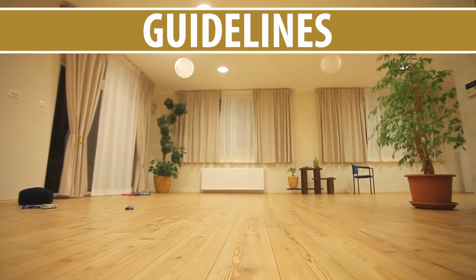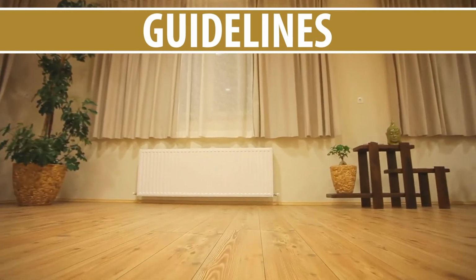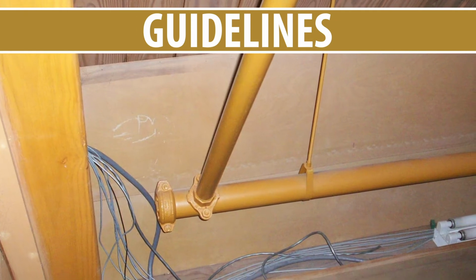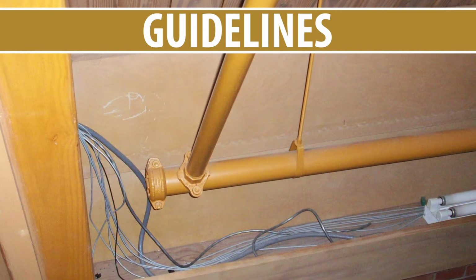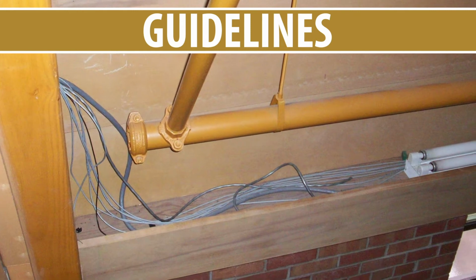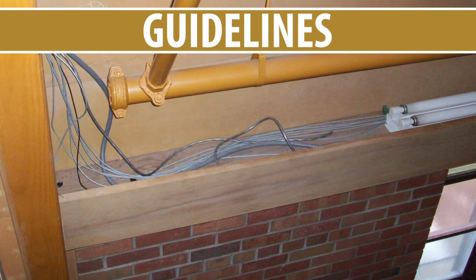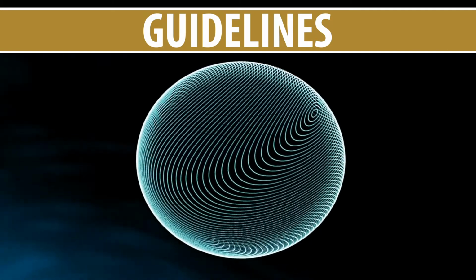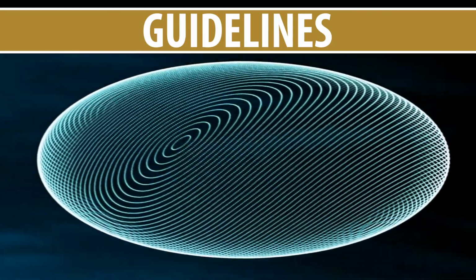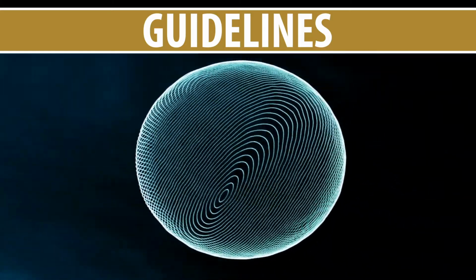The antenna can be installed at floor level or as much as 3 feet below the floor, depending on the size of the loop and the amount of metal in the structure. The antenna can be installed between 7 feet and 12 feet above the floor, depending on the size of the loop and the amount of metal in the structure. Very narrow loops will limit the amount of distance the signal will extend up and down. The loop is basically a sphere with the top and bottom flattening as the width increases. Conversely, height decreases as the width is reduced at the point that the sphere is round.